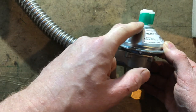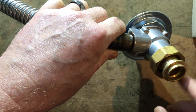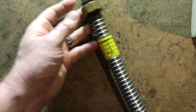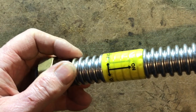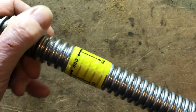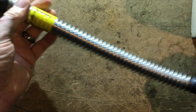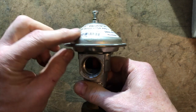There is an O-ring here and every time you disconnect a gas meter you have to replace the O-ring. There's also one at the other end of the anaconda which goes onto the ECV. This little sticker is a label for the customer telling them how to turn the ECV on or off — you should be carrying this tape so if it's missing you put it on yourself; you wouldn't call Cadent out just for that.